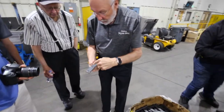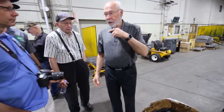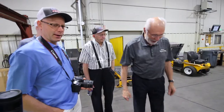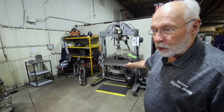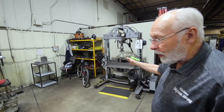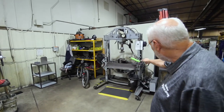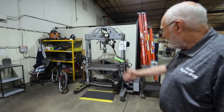You can see how the cut is — it's already got three holes punched in it and a notch. They cut about 15,000 pounds of steel per day to make the parts for the machines, and right now they're running at 28 machines a day. Those two lighter-colored machines are automatic band saws that make a very nice cut. The green machine with the orange is an ironworker, which has a shear like scissors that will cut steel — not quite as nice a cut as a saw, but still very good for a lot of parts. And this is their oldest tool — a World War II surplus hydraulic press that Caleb's dad bought in Wichita, Kansas. They still use it to flatten material and do some bending. It used to be hand-pump hydraulic; they put an electric motor on it years ago.